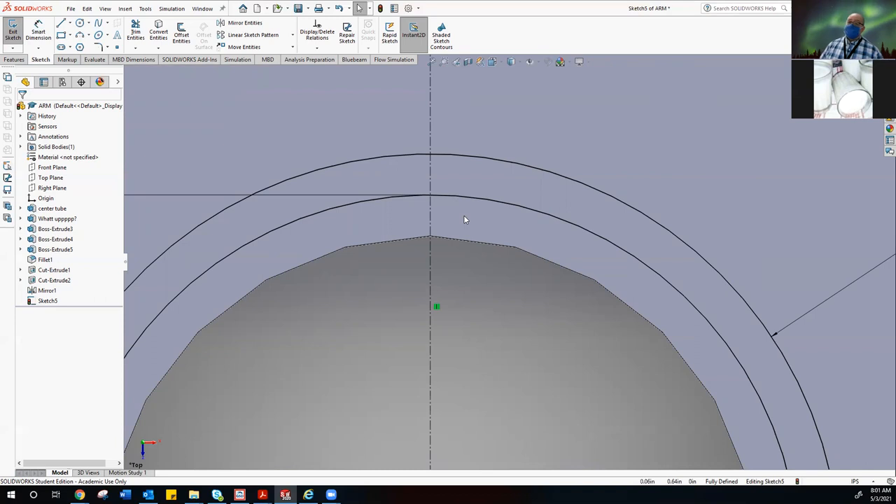Take your fingers — this is your gear, your fingers represent the teeth. Shove those fingers all the way in as deep as you can and move your hands up and down — see how much motion you get? Pull your fingers back one knuckle and look at your motion. When we put gears together, we never want the teeth to go all the way into the gear cavity — they bind up. When you grind your gears in a car, you're ripping off the tops of teeth and can wear them down to where they won't engage at all.